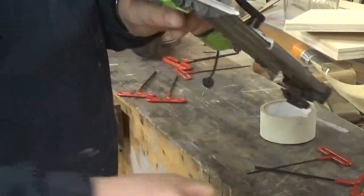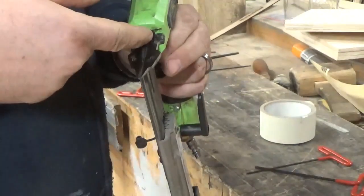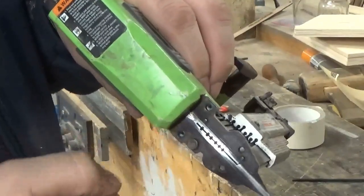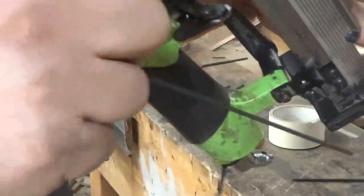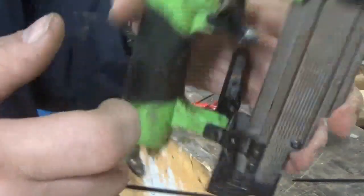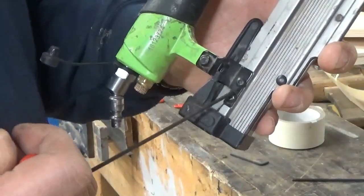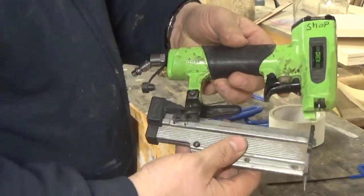You see your hammer. Go ahead and push that up. Alright, so the hammer's been pushed up and these two screws are removed, so we can push this forward and lock it. Now it doesn't really matter, nothing's pushing up against the spring here. Now I want to remove these two screws right here. This should come right off.